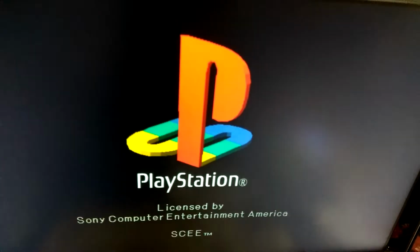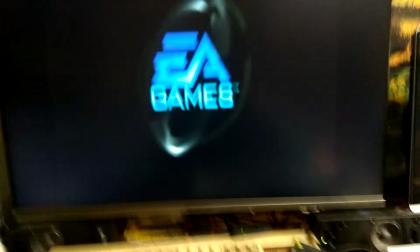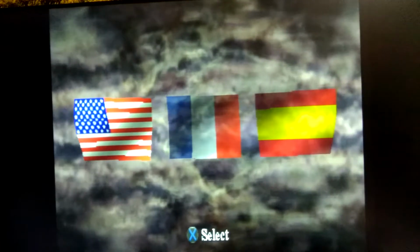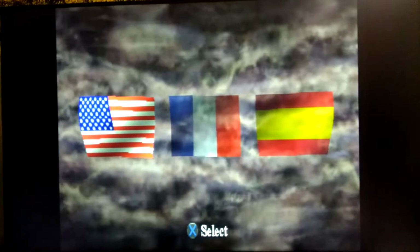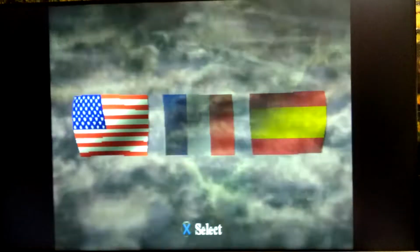There are two problems. One is with the whole setup: it won't work on a CRT television. This will only work with a scaler, such as the GBS that I'm using, because you'll have to supply a 1 to 3 volt power source on the sense pin, which enables RGB mode. So on the CRT, there's just nothing.